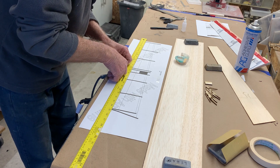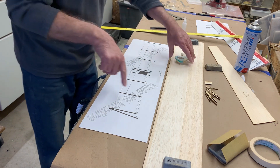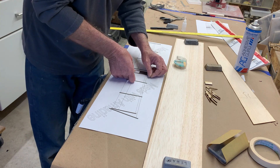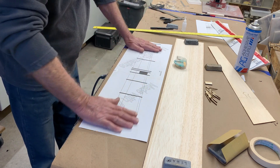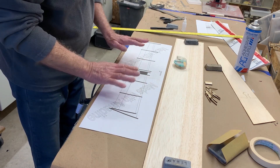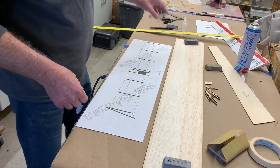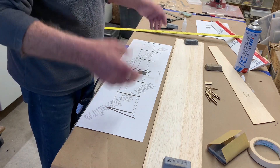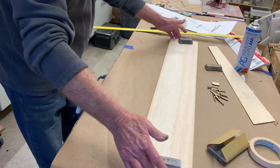It is straight — straight enough anyway, probably about five thou out but we'll see. I'll just pull this in a bit and tape it. I've used this method of printing legal sheets to scale on planes over six feet in fuselage length — made stations from it, built plugs from it, it works great. It's a great tip if you don't have a plotter or don't want to spend 50 bucks at the printers to get your plans enlarged, because enlarging plans can put you out an eighth of an inch.